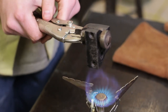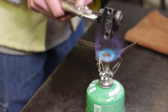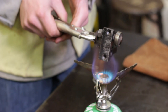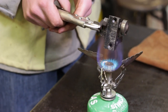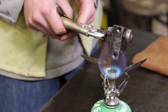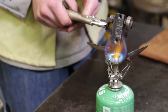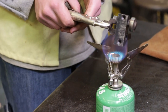We're just going to start preheating this part a little bit, because you're actually supposed to preheat cast iron before you weld it. If you don't, it can actually crack — even if you're not repairing a crack, just welding it fresh. If you heat it up with just the welding rod it can thermally shock the metal and crack it. We're preheating for two reasons: to get more penetration with the rod, and to hopefully prevent any cracking.